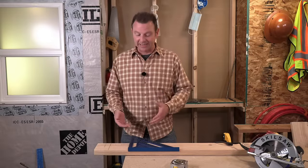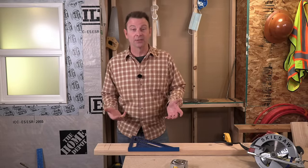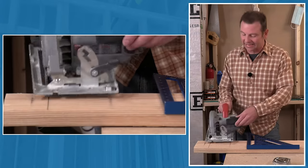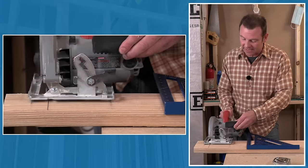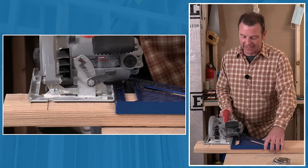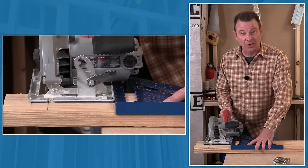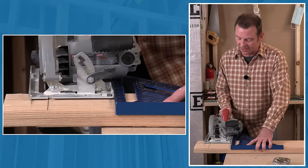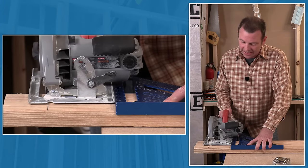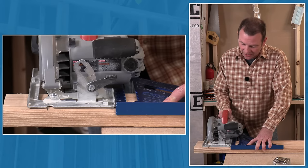Here's a great technique for a perfectly straight cut with a freehand saw like a circular saw. Line up the blade with the mark you've made, then pull the speed square into the base plate of the circular saw keeping it tight. Hold on to the speed square — don't let go — start the saw, and push on through keeping full contact with the speed square all the way through the cut.